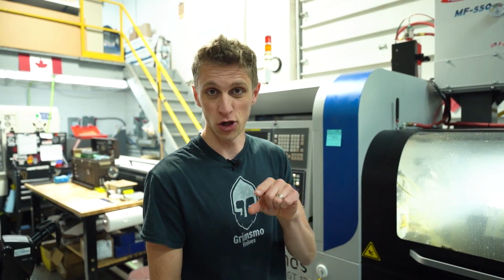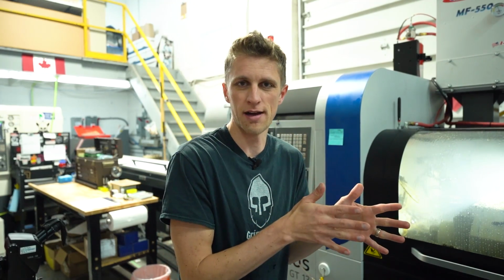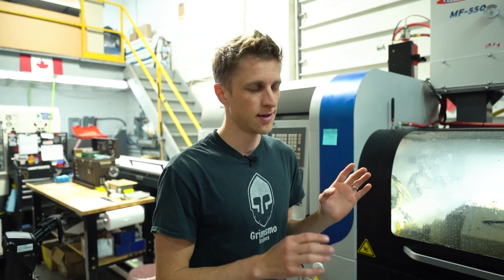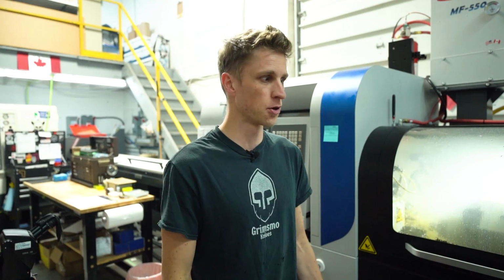There was this one line of code, we'll show you right here, that said move the z-axis 35 thou, which I used to have to do when the machine was set up in chucker mode, and now I don't have to do it anymore, and it was causing all of my problems. Delete that line, it's working great. I've made 120 parts today with only the first 2 scrapped, and then everything else after that's been like 1/10 tolerance. Super duper happy.